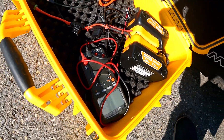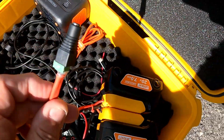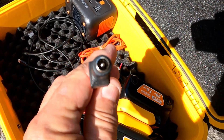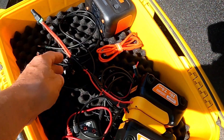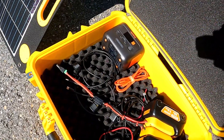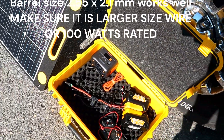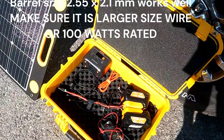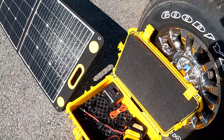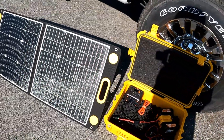The batteries do have a battery indicator on the back, and both of them are fused. It connects via that CCTV-type plug, and you just use the regular cable that comes with it. You can also power it with a shorter barrel connector that meets the size requirements. It's really important to get the inside diameter of the plug correct — otherwise you'll have problems with the unit resetting itself, because intermittent power causes it to go back to factory defaults.